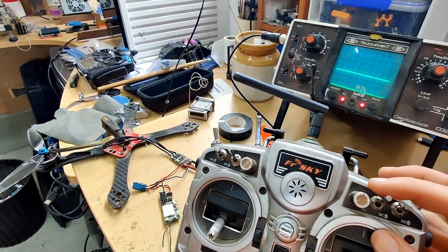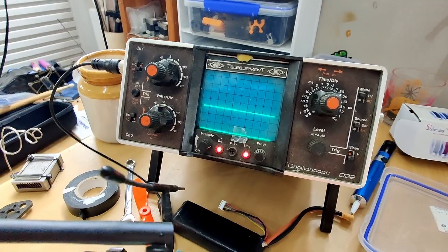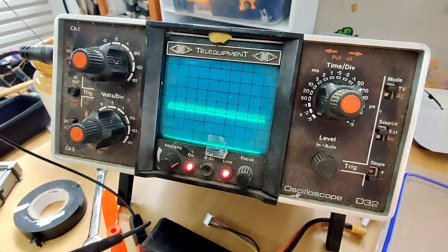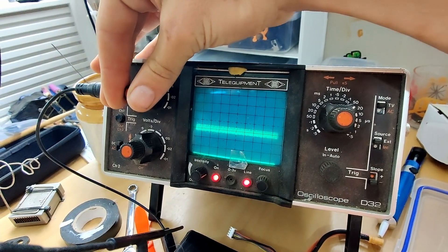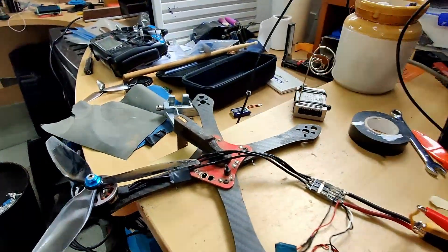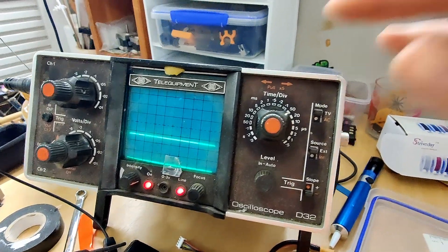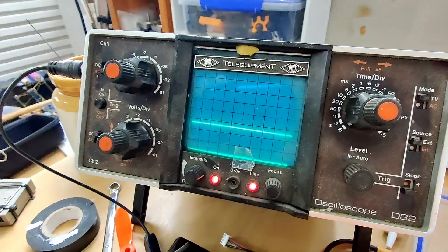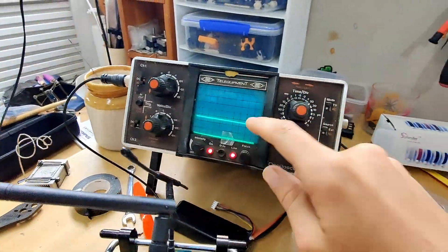You can see that there are actually two battles we're facing here, and I believe we need a different solution to account for both of them. The first is that when the motor is running we've got this noise — approximately one volt — and that's at a relatively low RPM, so that noise does need to be cleaned up. That noise is extremely high frequency; each grid on the x-axis is 50 microseconds, so the frequency of that noise is probably up around whatever PWM rate the ESC is running.